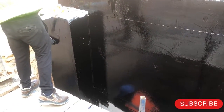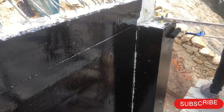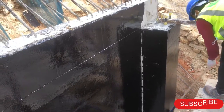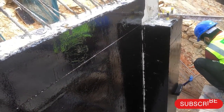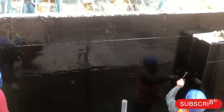You submit a WIR for the first coat of bituminous paint on the concrete walls and columns. When it's dried, the consultant comes and checks the first coat or first layer of the bitumen coat. After approval, on the next day they start the second layer, which is the final layer. When that bituminous coating is complete, you submit another WIR for the final coat. The consultant comes, checks, and approves. After approval of the second layer, you can proceed with backfilling.